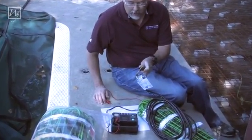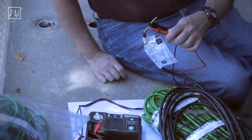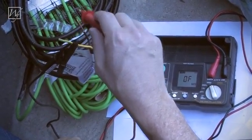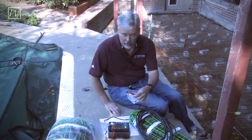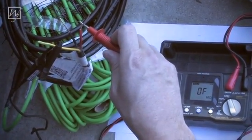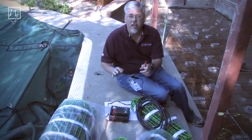I'm going to attach the ground to the ground wire, take the probe and attach it to the black wire, set it for 500 volts, and hit measure. What I'm getting is an OF — overflow — which is exactly what you want. It means infinity; the two wires do not see each other in the mat. Now I'll go along the other conductor, the red one, and make sure I get the same reading. I'm getting overflow, which means I have infinity between the red core and the ground. When doing this test, keep in mind it is 500 volts, so be careful — the last thing you want to do is grab any of these wires right now because there's a chance of getting shocked.